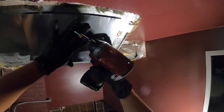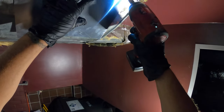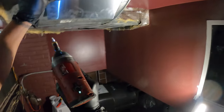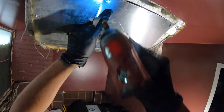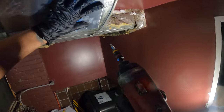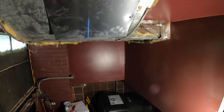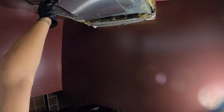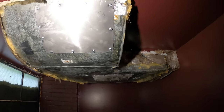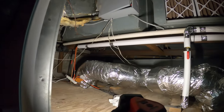Just gonna put this over right there and zip it in. I'm gonna put some screws on and then use some duct sealant — that's gonna seal this up real nice. Let's get this all in. Got that one in, let's do this one and have the piece ready for the inside over there. Center this so we're good, zip these in. That's closed and that is closed. You could even tape around and then paste for extra protection. Let's seal this up.